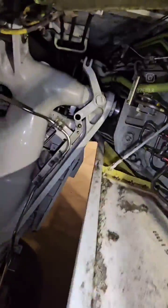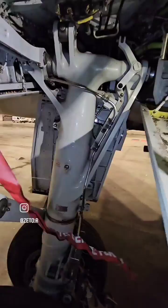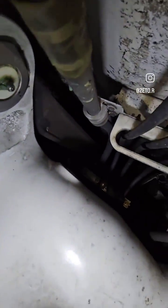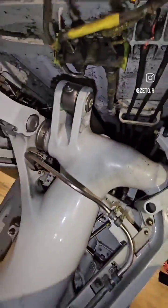Then the volume fuse in the up-pressure line closes when the hydraulic flow through the frangible fitting increases to 3 to 4 liters. This stops the loss of fluid from the hydraulic system.